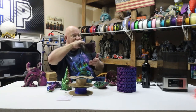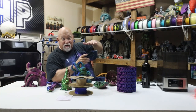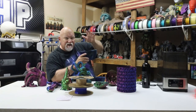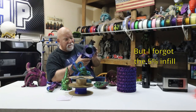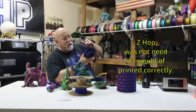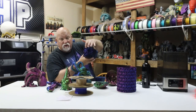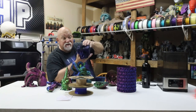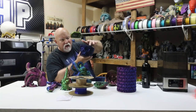I had a problem — I wanted to size it up to 150%. When I dropped this in my slicer, it had a top on it. I figured it was like a base, so I put zero top layers and zero infill. When I sliced it and looked at it I realized that was wrong, so I went ahead and put the top back on to make it solid. While I was printing it, I got about three quarters of the way done. I didn't have Z-hop enabled on the printer, so when the nozzle was coming down these little ribs were moving and it was starting to screw the print up really bad. Instead of wasting more filament, I just stopped it. I forgot to put like 5% infill in it to lock it with the top on it. The nozzle kept bumping the ribs. As far as quality, it came out beautiful — failed print, yes, but user error, my fault.